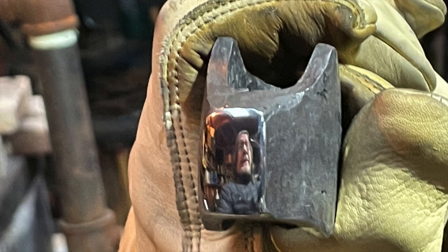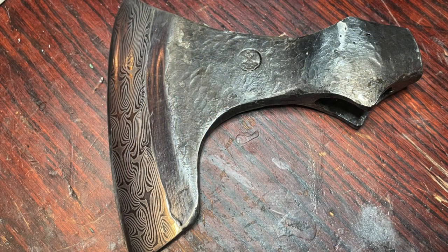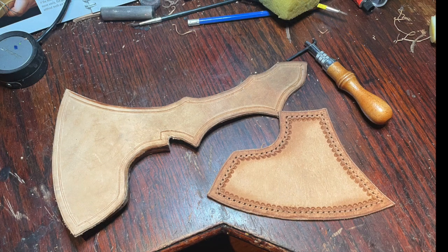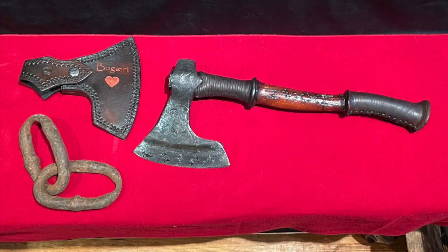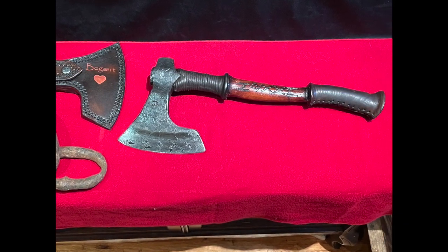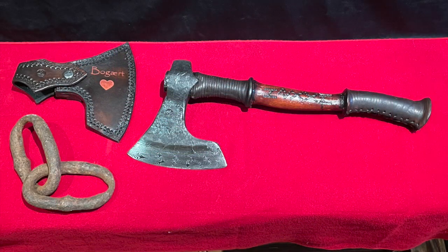Reaching the end of the build. We've got a polished hammer head and a polished cutting edge. Now we move on to the sheath — took me a couple of times to get that right. And then put it all together and you have the finished product: an 8th or 9th century Viking axe in my style. Turkish Twist Damascus on the cutting edge, with wrought iron chain and 1084 powder as the main head. Thanks for watching.